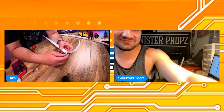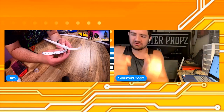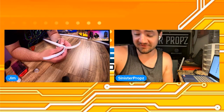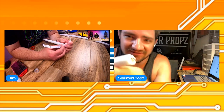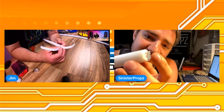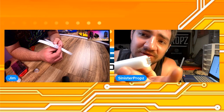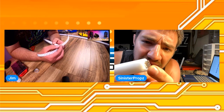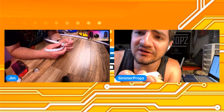And then help me out here. I want to make sure I'm doing this right. So I peeled it like a banana. I have a low side and a high side. All the way until it meets the diffuser and where you cut the foam. And then you're going to cut the NeoPixel strips like this, as close as you can get it, but exposing as much of the pads as possible. The pads that are right below the NeoPixel. Oh, there's proper pads that say G, plus, and is that a D? I think it's a D, should say D.